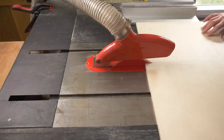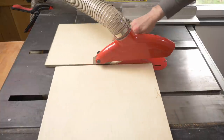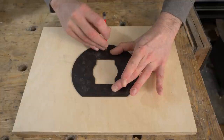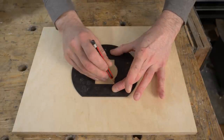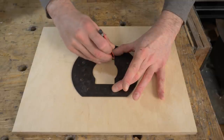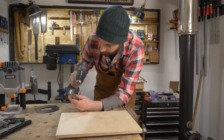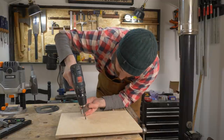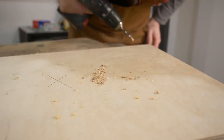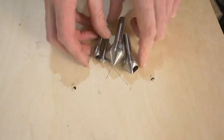I get the parts cut out on the table saw. This is not an ideal cut to make, and that's why I will be making a panel sled. But I was just being careful. I'd taken the plate off the base of the router, and I could use that to mark out onto the 12mm ply where the holes for mounting it would need to go. I want the heads of the bolts to be under the surface of the table, so I need to countersink all these holes.